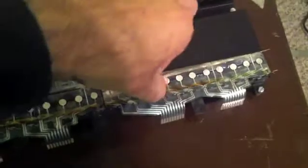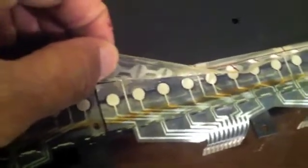this whole surface back, because again you have to clean the little round silver dot you see and the dots on this side. And when you're peeling it back, you have to be very careful not to rip it apart, because all of the traces for the circuit are embedded in the plastic. So if you rip through one of them, well, you have a project ahead of you. So be very careful.